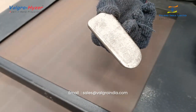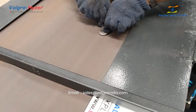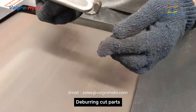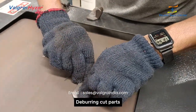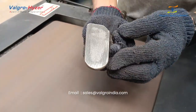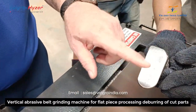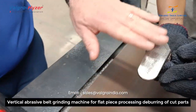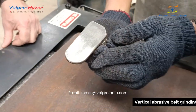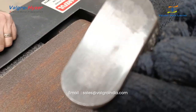Here you can see the rough edge, not quite square. Now you can see we've removed all that extra material on there, making the bottom very, very flat. That's going to allow the part mating surface to have complete contact. So very nice. And then depending on how much deformity there is in the base, they just grind for a little bit further period of time.